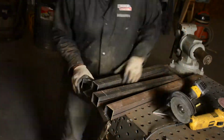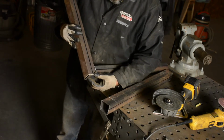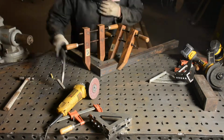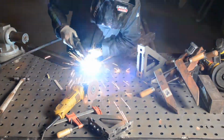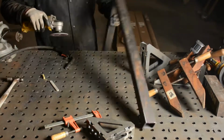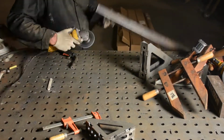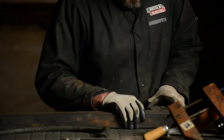And you notice here, this is me just doing that splice. Again, just doing it all with the grinder by hand. And then I'm doing my tack welding, and again jumping around where I know I can. When I'm right against the bend inside the end of one of those tubes, I can really blast it, but when it's 2 ends of sheet metal together, I've got to do my tack method, otherwise I'll melt through.